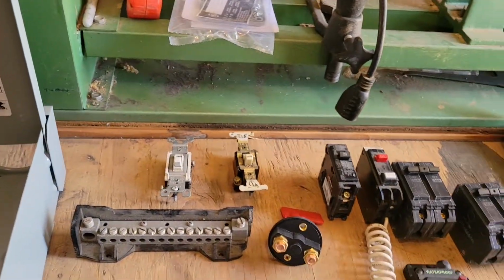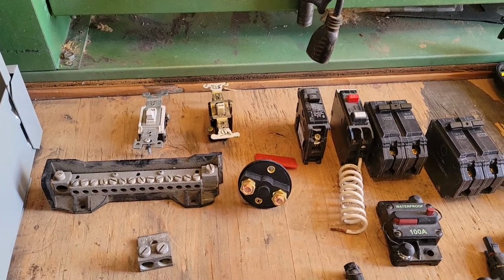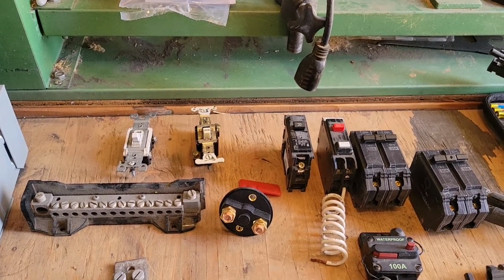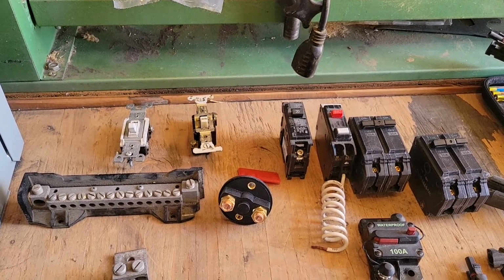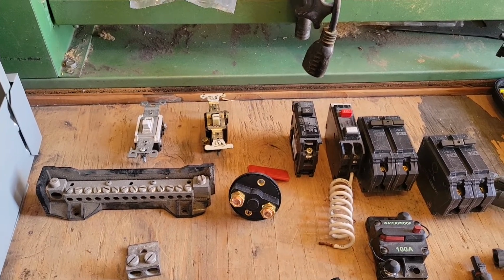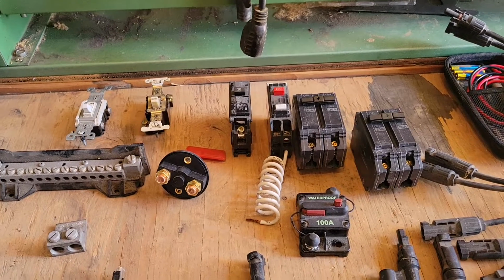So now the last thing, before we get really long here: the brake switch for a turbine. Okay, I don't use one. Why? Because a brake switch for a turbine is designed for 3-phase turbines only. You wouldn't do that on a single phase with just 2 wires coming in, your positive and negative. You'd have the 3 wires of the same color coming off your turbine. That's a 3-phase, okay? It's an AC turbine.